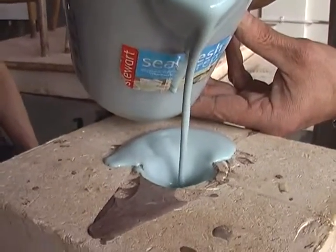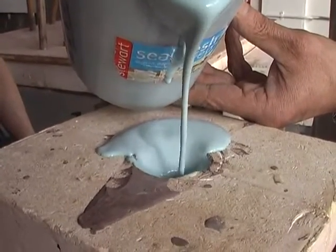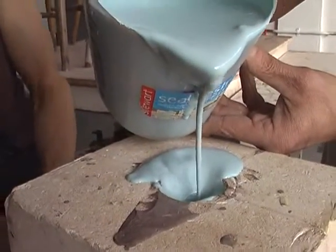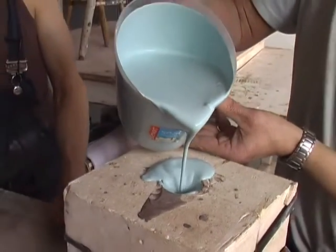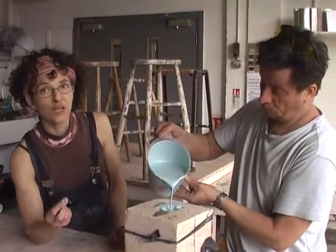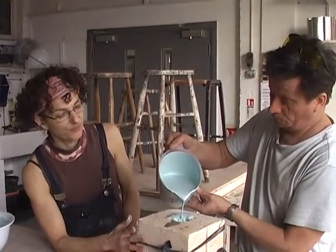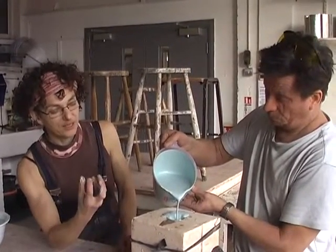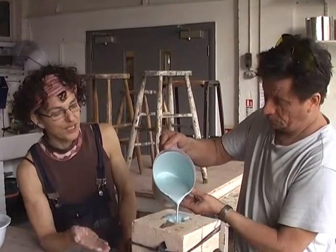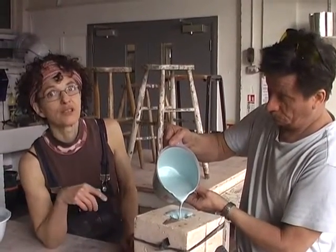What's happening — I'm just filling it right up so it fills the whole thing. You're going to overfill it, right, you'll see it. Because while the wall of the sphere is forming, the water is being absorbed by the mould. And all of it sinks a little bit, so what you do is overfill it, and if it sinks too much you could add more while it's forming the sphere.